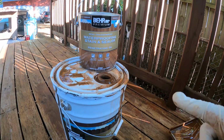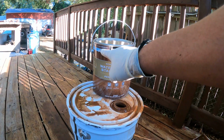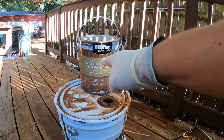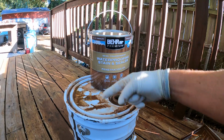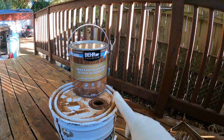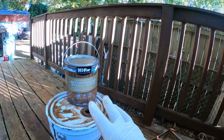But the important thing here is Home Depot also sells a Behr product in the exact same color that's water-based. And if you grab 1 can of this and 1 can of that, you may not notice the lack of that word right there. And suddenly you've got oil and water you're gonna try to mix in your mixing thing. So that's not good. Be really careful.